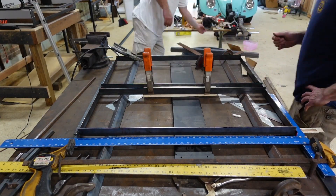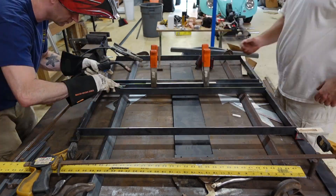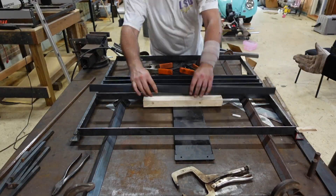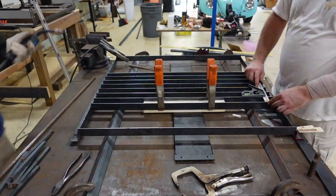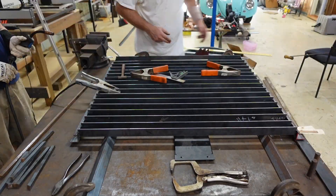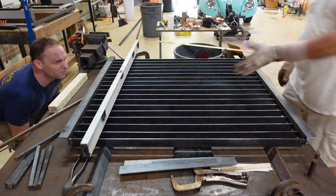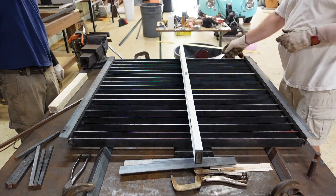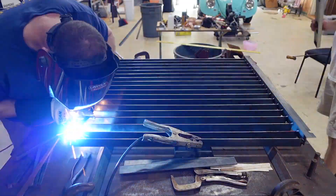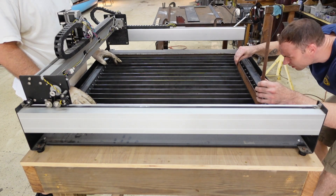Assembling the cutting surface turned out to be the hardest — or at least the most annoying — part of this build, primarily because I don't have a flat surface to work on. My welding table is badly warped in the middle, but after a lot of shimming and welding and re-welding, we managed to get a pretty flat surface. This is important because the torch head needs to remain less than an eighth of an inch above the top of your work, and without a torch height controller any variation in flatness could lead to a bad cut or a crash. Typically a plasma table has removable slats you can take out as they get damaged; we decided to just tack weld these in, and if we need to remove them later to chip away some slag we'll just grind the tack welds off.